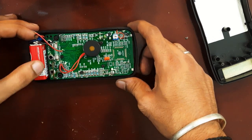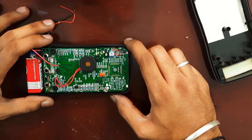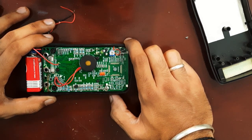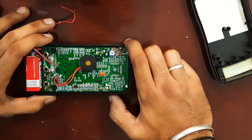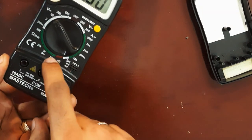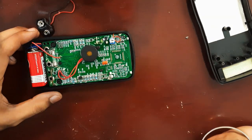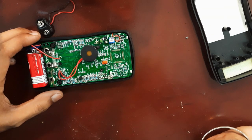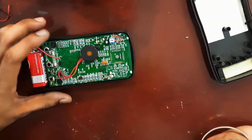Usually the multimeter uses the battery voltage to operate, but here the damaged connector meant the voltage wasn't being delivered at full capacity, so the multimeter couldn't operate correctly. That's likely what caused the uneven voltage readings. Even the continuity tester wasn't working properly — it was showing uneven resistance values, and for a short circuit it was showing close to 500 ohms, which was again because of this connector.